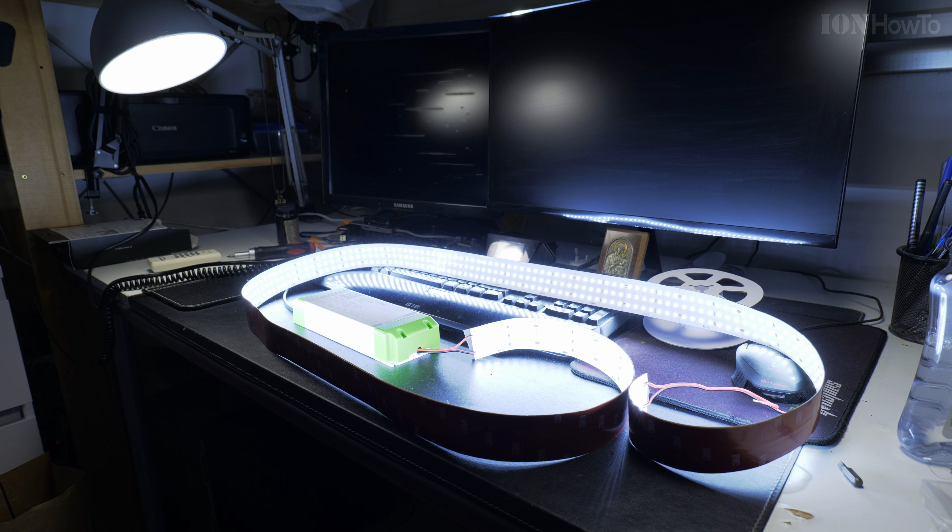Here it's pretty simple: plus is the red, minus is the black — negative and positive. On the DC voltage side it's 24 volts. The current is limited by the current limiting resistors on the LED strip — you'll see them at some point.